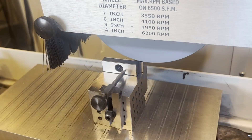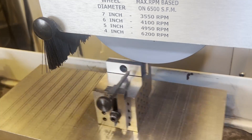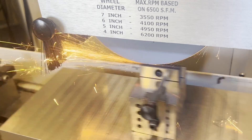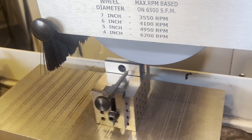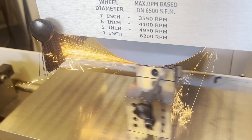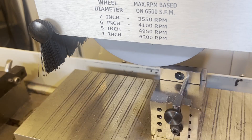I don't typically use this process on the CNC — this is more something I do on the manual grinder. But the CNC grinder made it very easy to demonstrate here: I could get really consistent step overs and it was a lot easier to film. It is sometimes useful, as I said, if you have a flimsy setup and want to keep tool pressure down, or if you have very small parts with heat issues. But for most flat plates and squaring, I'll use a traditional grinding approach with flood coolant.